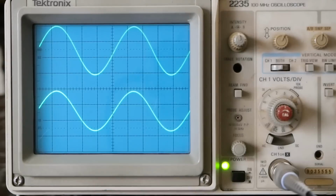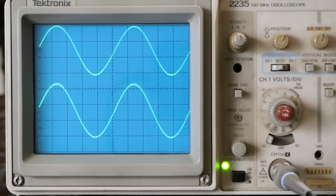When I've worked on amps that had VU meters that were accurate, people complained they didn't move enough. And so this is probably a good calibration for what people are going to be actually using VU meters for, and it's strictly just for appearance. So anyway, let's get on with the testing. I'm going to test it at this setting here, which is just past unity gain, and then let's see what it does at different frequencies.